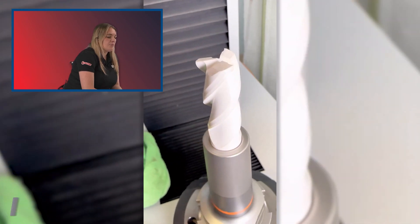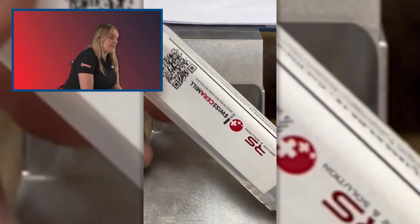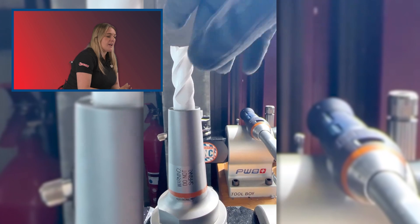Okay, so we've got a ceramic tool — white tool. We're able to measure the tool: in this device here, we can stick the tool holder with the tool in and measure exactly how much that tool is sticking out the tool holder. Why would you use ceramic? Ceramics — it's not made out of the same stuff your grandma's teacups are made out of. It's a different ceramic, used for aluminiums and coppers. Is it because it takes heat well? Yes. This device measures the height so we can stick that straight in the machine — it's really accurate and it means you're not touching the tool onto the job and taking it off the datum point, the Z minus datum point.